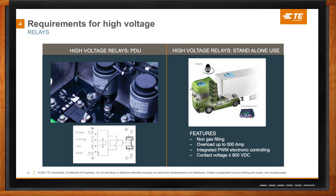These values are scaled by a constant current. As the voltage increases, the endurance or cycles decreases. For the emergency make and break, this would be the minimum value that the relay can make, and more importantly, break contact at least one time in case they need to switch the system down. For the physical design, the decision making is easy since these relays can be used as part of a power distribution enclosure or the standalone unit. Only the physical dimensions need to be considered.